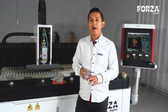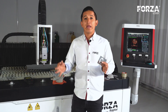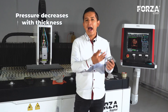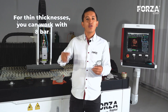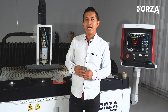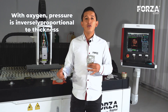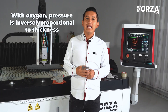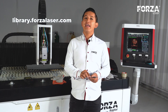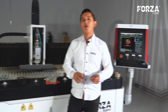You can now see what the experience of working with galvanized steel is like. A very frequent question is about parameters. When we work with oxygen, the gas pressure decreases according to the thickness. For thin thicknesses, I can easily work with 8 bars. But for thicknesses of 4mm, 3mm, and even more, I already have to lower the pressure — I work with pressures of 1 to 1.2 bar. The pressure is inversely proportional to the thickness. This and much more is already solved in our parameters. We have a library that you can also access, and if you have a machine, you simply download the parameter and you avoid all that work.